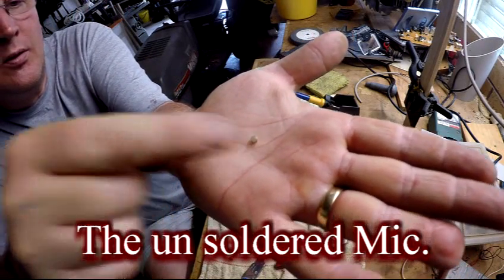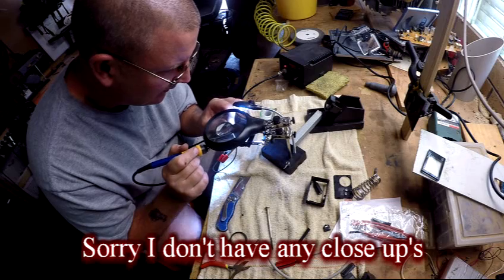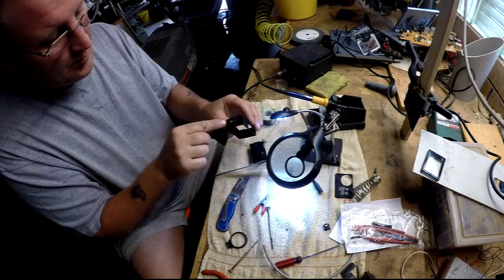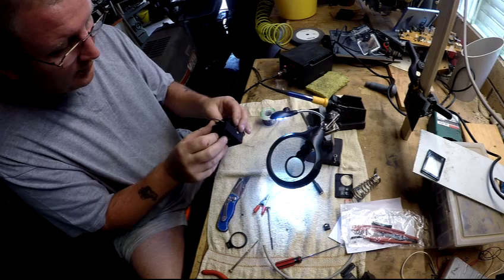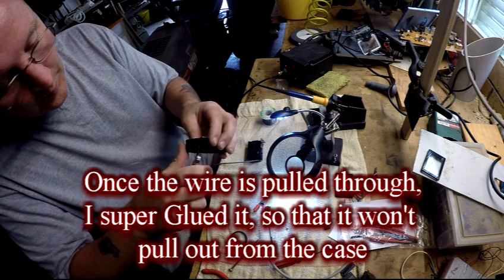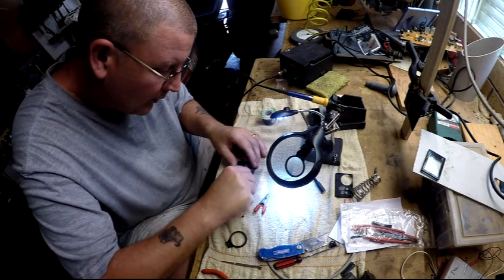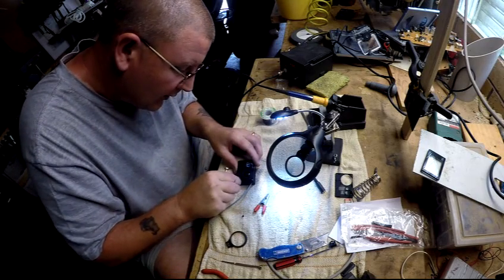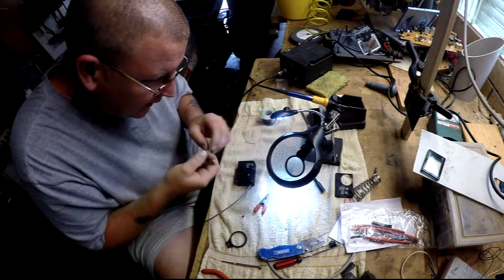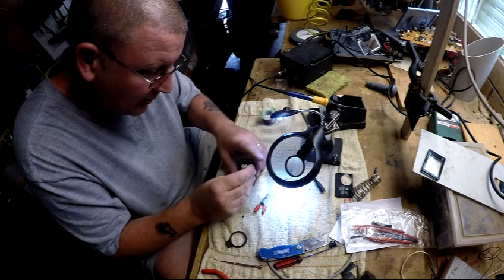Look at the size of that. Now I've got a wire and now comes the fun bit - trying to solder that back in there. We need to make a hole in the case where the microphone used to be so we can bring the wire through. It must be very small people who make these things. I still can't get over why there's not an external mic option available for it - seems ridiculous. They copied everything else off the GoPro.